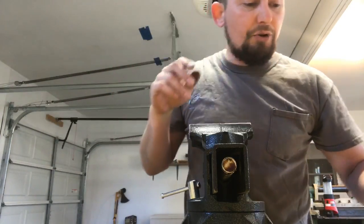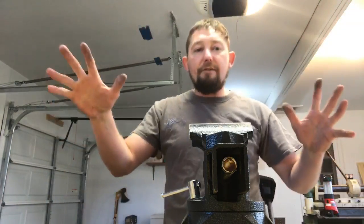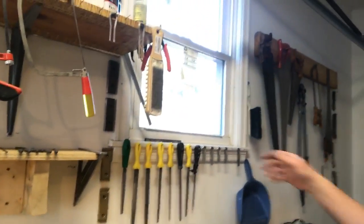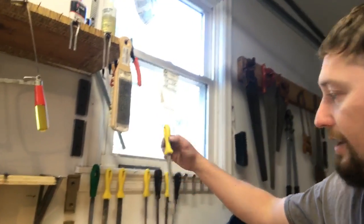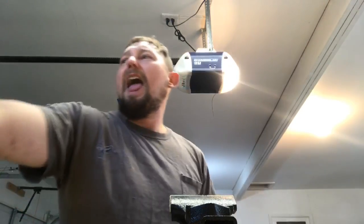And I find it's best to keep your tools organized, pretty much in any trade, because I build sheet metal as well. I work in a shop sometimes. If you're gonna have a shop and you're doing stuff, make sure that you kind of have stations thought out. This is the station where my two vices are. And then I also have all my files and everything that I need to work in this station within arm's reach. If we look on the wall, if I want a three square file, it's right there, it's put right back. If I want big triangular, it's right there. If I want regular files, it's right there. My four square files, coarse, medium, are right here. I never want to be traveling in the shop. I don't want to walk clear across my shop to grab something that I need, because then I'm just wasting time and wasting effort. Another thing is, have your tools hanging up, or have some type of organization for your tools, because if you just leave your tools in a pile, then you're spending a lot of time just looking for stuff, and that's not good. It's not gonna make for an efficient shop if you're spending large amounts of time looking for stuff.